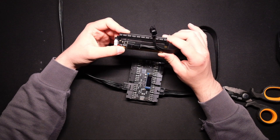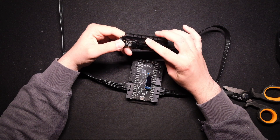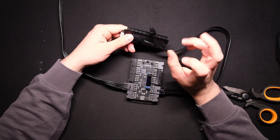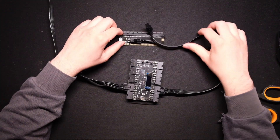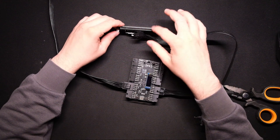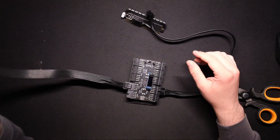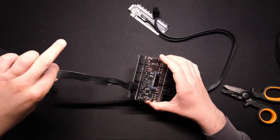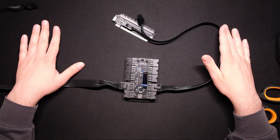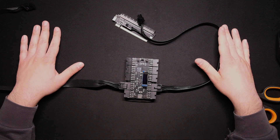We finally plugged it in — it was a bit tricky. I guess it's just because I don't have the proper cable; I probably should have listened to Elmore and gotten the cables, but I didn't, so I ended up modifying connectors. But that's actually how you connect this PCIe power measurement adapter to your system: it goes into the PCIe slot, GPU on top, and you'll be able to read how much power the PCIe slot pulls. To summarize: PSU to PMD, PMD to adapter.